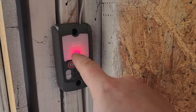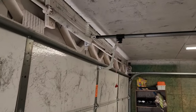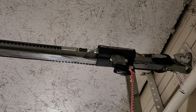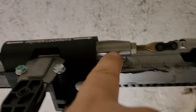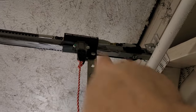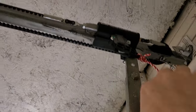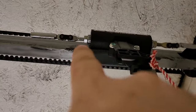This is the new one. With the insulated and padded door it's way quieter than the one I just took down. This is interesting — it only indexes at one point. This is the trolley; I can disengage it and there's an indexing slug right there. This piece is only on the belt at one point. What that enabled them to do is have soft limits — you can program your limits for up and down because the door only indexes at one point ever.